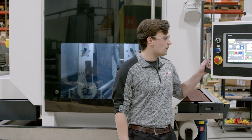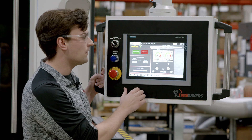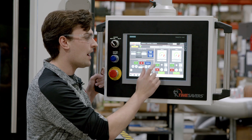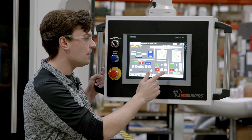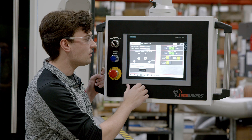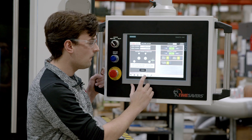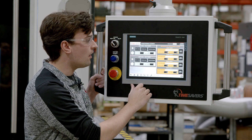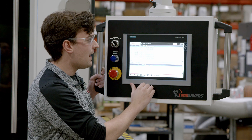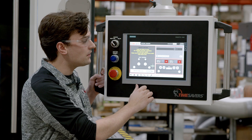Let's take a look at the control interface. We're going to take a look at our Siemens HMI PLC control panel. We have a couple different settings here: our auto control screen, we also have manual controls. You can adjust pop-up heads one and two out of the sanding line or back into it. We have conveyor bed controls and machine thickness controls. We also have settings to control on and off our air knife blower and our coolant system. We have a maintenance screen as well that can alert of abrasive belt wear and preventative maintenance alarms. We have an alarm history log screen and recipe storage — we can store up to 500 recipes in this machine.